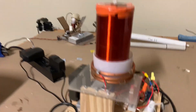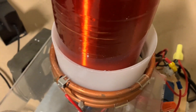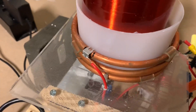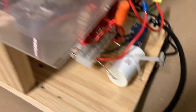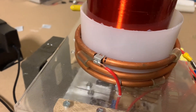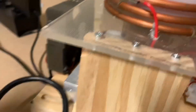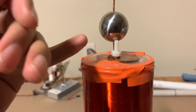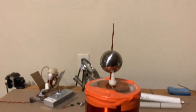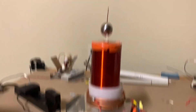Since the last run, I decided to take everything apart, make the primary a bit more snug so it's not as separated from the secondary coil, and tap it in a different position. I also changed the capacitance to a higher value — 150 nF instead of 75 nF. I probed it with an oscilloscope and it now oscillates at 329 kilohertz. That primary tapped right there is at 329 kilohertz, and the secondary with that steel ball and breakout terminal also resonates at exactly the same frequency.